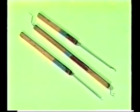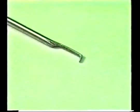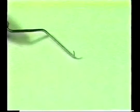These are the 3 homemade tools you should use in assembly for prepositioning, positioning, phasing, and adjusting the index guard. These tools are not absolutely necessary, but they make the job much easier. The pawl post pushing tool is made by grinding the eye of a large needle to a shape like this. The index guard raising tool is made from a large sewing needle ground to this shape. The wheel locating prod is made from a steel wire bent and ground to the shape shown here.